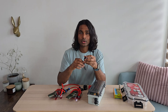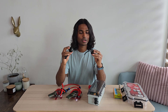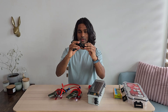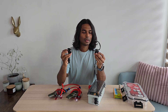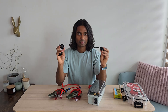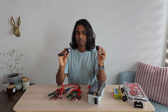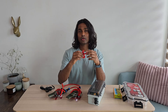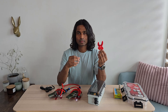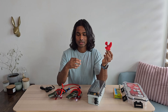First of all I would like to have some more power, so I got these new motors. If you see the size difference they are almost twice as large. These are 660kV instead of 380kV and these are rated for 2kW. I expect them to perform much better and I will also experiment with some different propellers — different shapes and different sizes to see which one performs the best.